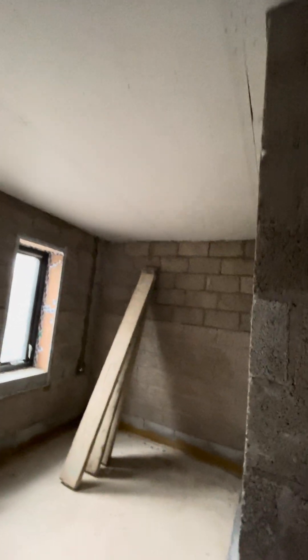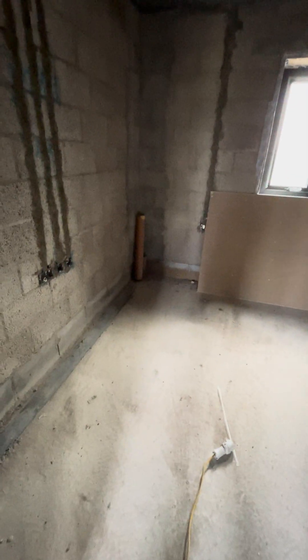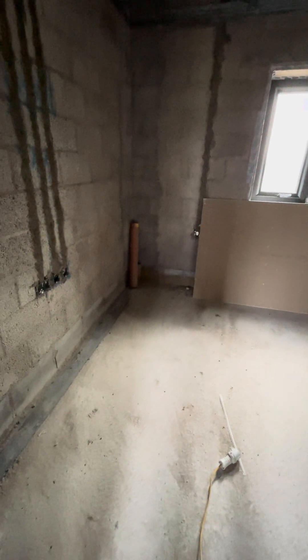Most of these details are very easy to do. You can see we've fully airtighted around these windows, and the slab wrap details continue through the wall right around all the perimeter walls where there are cavities. All the way through here, airtightening around the joints of the subfloor to the wall, and also around upstands — for example a soil vent pipe — sealing in around there and stuffing those gaps.